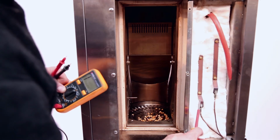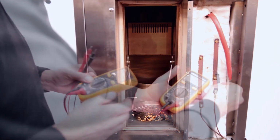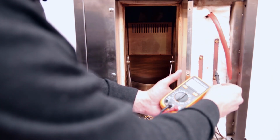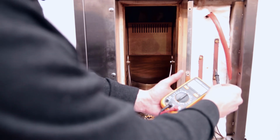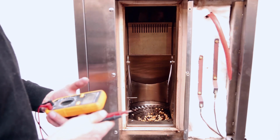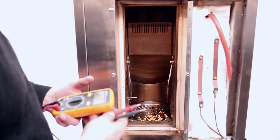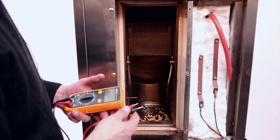You will need to check the heater's resistance, which must be nearly 11 ohm. Each heater's resistance is 22 ohm. At parallel connection, the combined resistance will be 11 ohm. If the combined resistance is either 22 ohm or infinity, it will mean that either one heater or both failed.